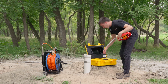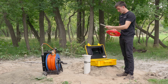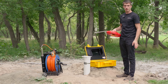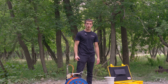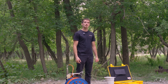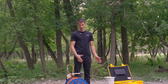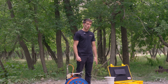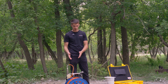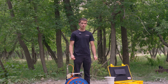The specific sewer camera would work in a well if it's a shallow or narrow well where the side view won't be a benefit because you're too close to the edges anyway. But if you're doing well inspections professionally, the well camera is clearly the choice. To conclude: the well camera performed much better, was a lot more convenient and easier to use. The sewer camera did work, but I wasn't really able to see the seams all around the well or assess it the way I was able to with the well camera. Maybe in a narrower diameter it would work, but not even close to how well the well camera performed. You can check both cameras out on our website — links are all down below. Thanks for watching and have a great day.